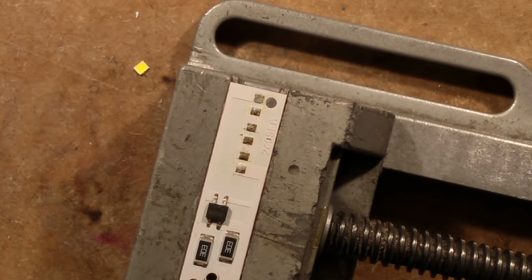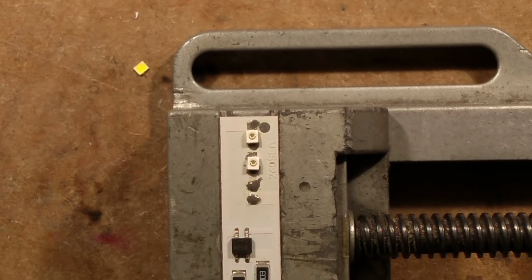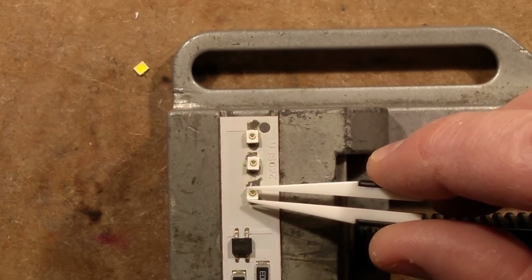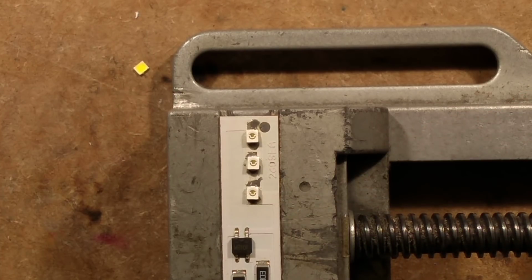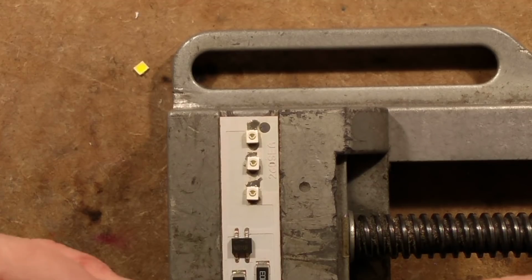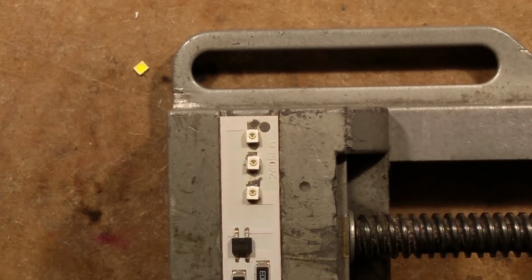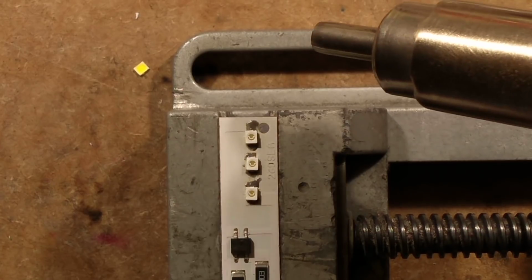Okay, it's definitely gone Louis Rossmann now because solder paste and everything. Wow. It's not really a first major surface mounted thing. It's the first time I've used the solder paste. I'm expecting everything to just slide in, assuming I have applied solder paste and not heatsink compound. Hold on, I'm just going to check. It's an alloy of lead and tin. It is solder paste. Let's get the heat gun in and see if these flow into place like all those other videos show happening.